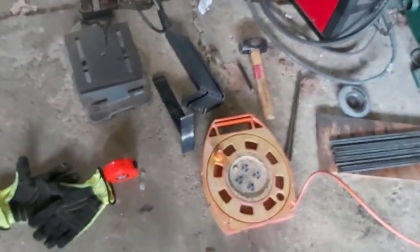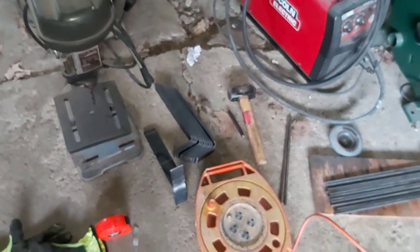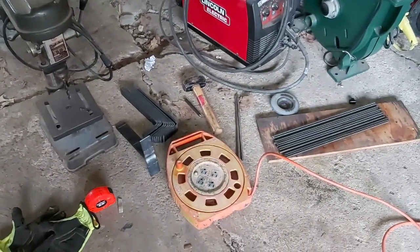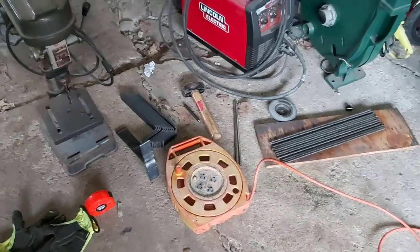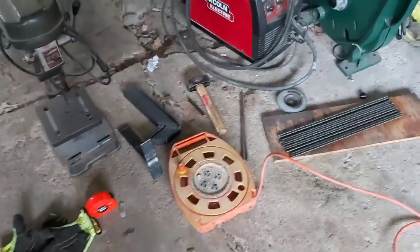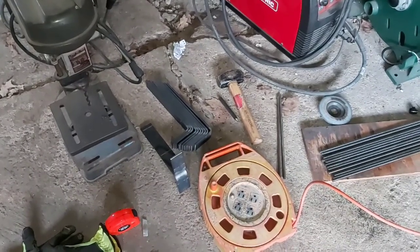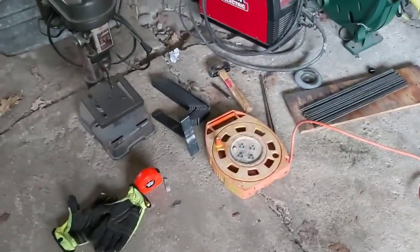Pretty easy go. It's going to be a 10.9 kilowatt hour battery bank, 48 volts. It's pretty heavy. Each one of them was like 27 pounds, and 3 would be 9 total, but 3 groups of 3, and they'll all be paralleled. That way I can put the smallest amount of wire on there as possible. I like using the 4-gauge wire on these. I think a 3.6 kilowatt hour bank is pretty reasonable.